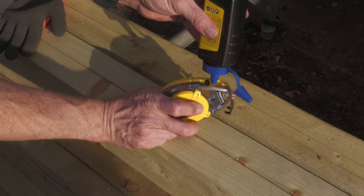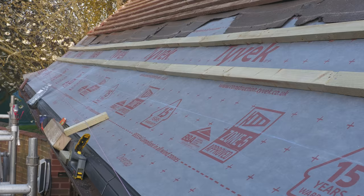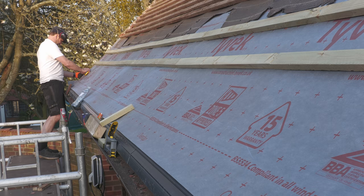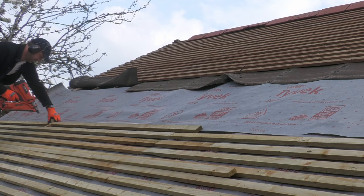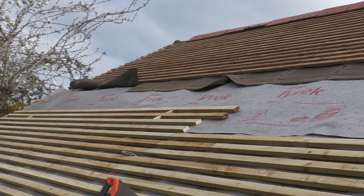I bought a chalk line, which I thought would be a quick way of pinging a line across the roof to know exactly where to fix each batten. It's a fantastic tool, but Tyvek recommend leaving a slight sag between battens, and the chalk line doesn't always leave a mark on the undulations between each rafter. Working alone also makes it impractical to ping a line for each batten. So the quickest solution was cutting small individual blocks to the exact spacing, which I could place between each batten to ensure the correct position without measuring each time.